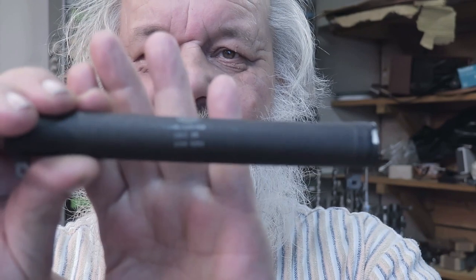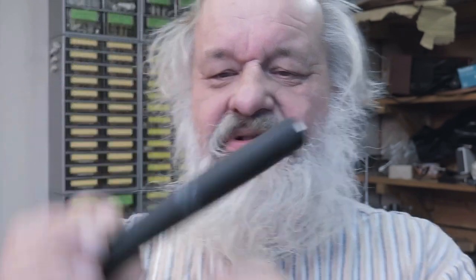That's not a very good option. I could use a 100 ohm resistor. I have one here. That's 100 ohms, 100 watts. The power is quite correct, because it's a temporary thing, but this is too large. I need a little bit lower value, something like 40 ohms maybe. So for this reason we are going to make a resistor today. I have some resistor wire, and I do have an idea how to make this resistor. So let's go to the workbench first and do some measurements.